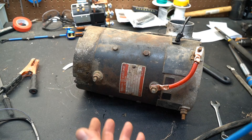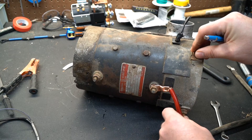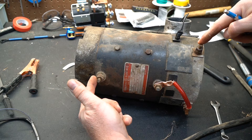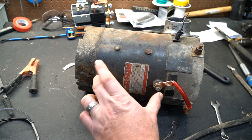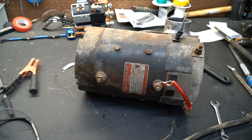The only way you can make this motor spin the other direction is to disconnect the way you have it in series. If you put power here it would spin the other direction. What you're doing is flipping the polarity of either the armature or the fields. Put them back in series and it'll spin the opposite direction.